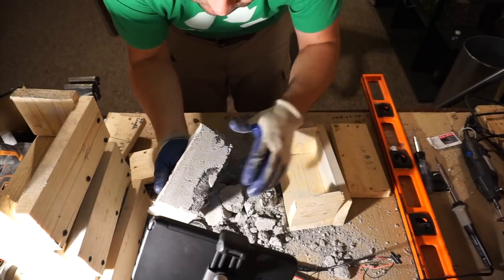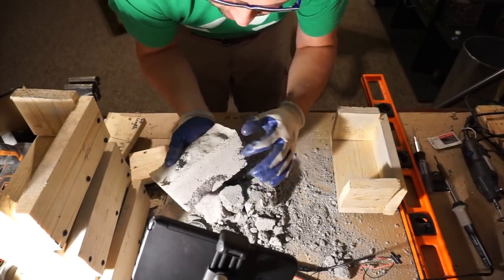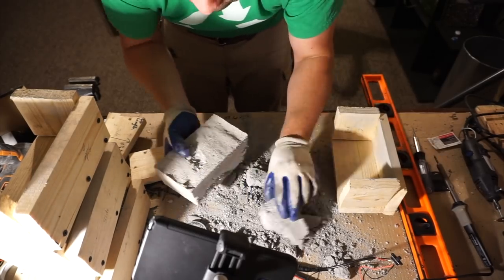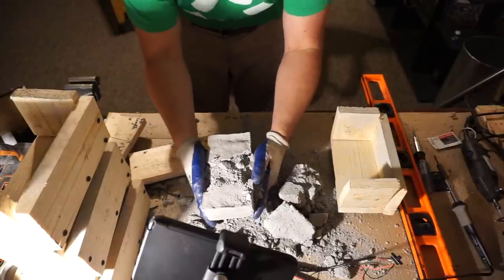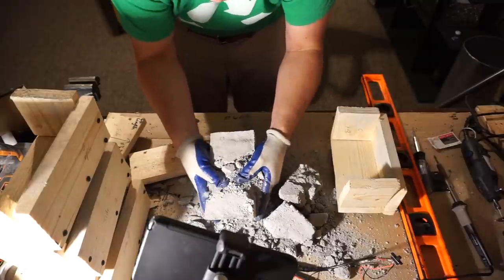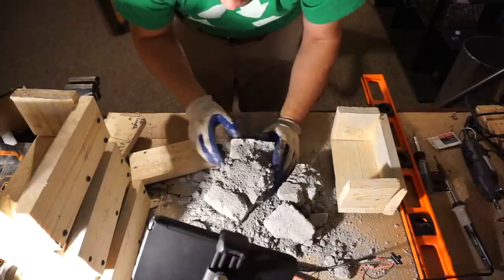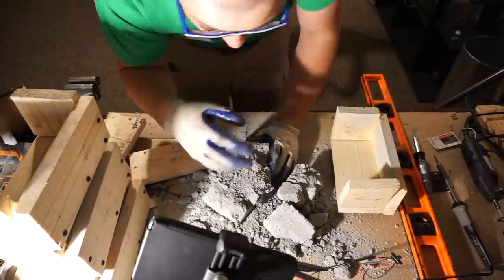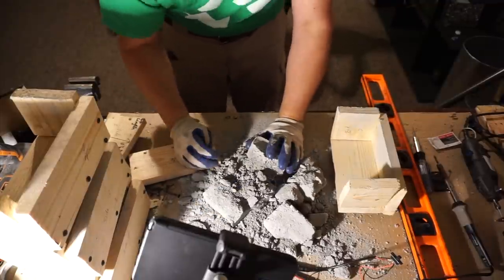This was the first brick that I poured. It was the lightest of them all. And it was also all the Aircrete that was on top of the bucket. It was kind of fluffy and it really didn't feel like concrete at all, which might be because it wasn't mixed right. It didn't hold up with the consistency. I tried to put some steel wool at the bottom, just trying to experiment where the steel wool might add some reinforcement, but it just fell apart in my hands. So the light and fluffy Aircrete wasn't the right consistency.